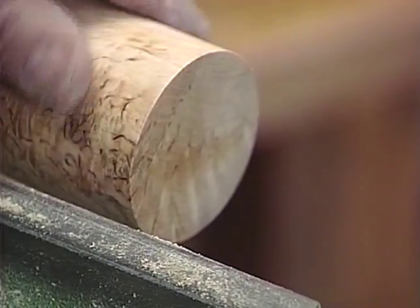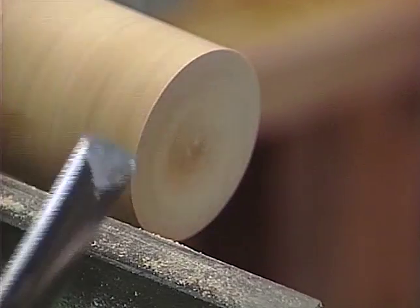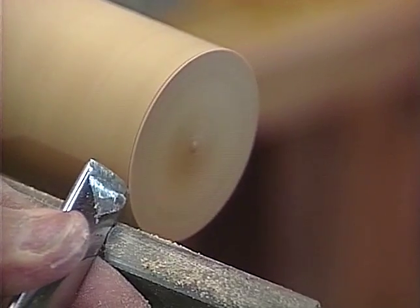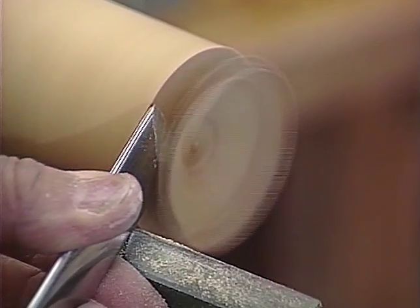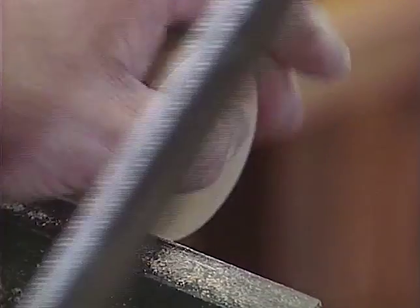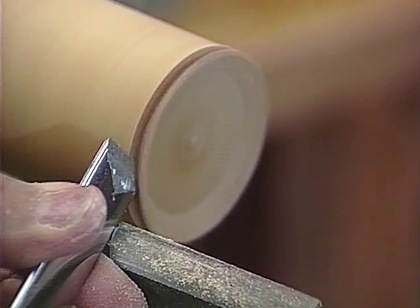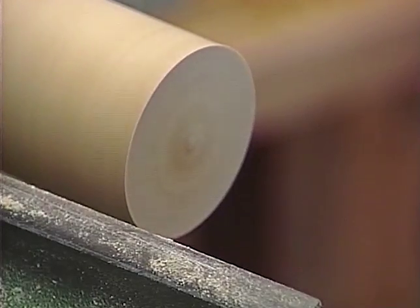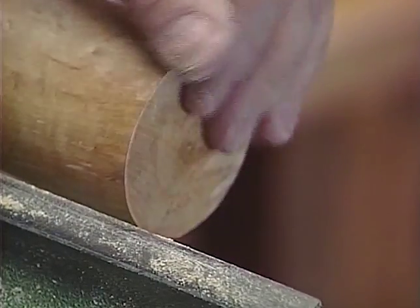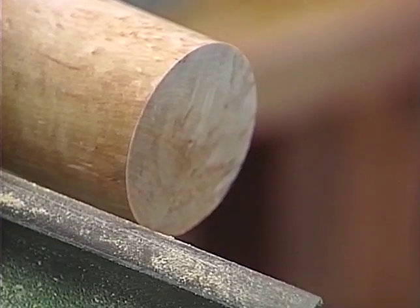I've just shown you cutting with the fingernail gouge. Now I'm showing you that you can clean that end with the skew chisel. You can see that little waste block fly off the end there, just looks like a little coolie hat. And that tool will give you the cleanest cut that is possible to achieve on end grain. It's also the most difficult tool to use. Just have to remember that it's only the edge that's cutting. Don't let it lean over, else it kicks back.